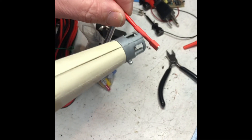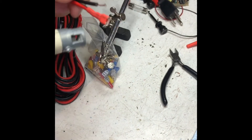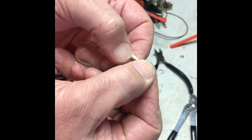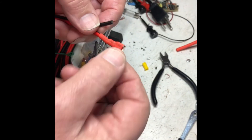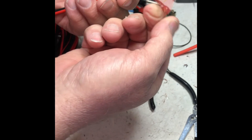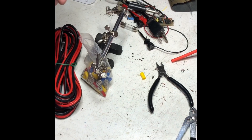I like this better — more water resistant. Plus, you saw how flimsy that piece of metal was — it holds on better. If the original piece had been crimped only, the only strength holding that wire would be these little crimp tabs, and when you go to solder those get gummy and when you pull it off the other side it could pull right off. But this is soldered on, and the heat shrink tubing goes all the way down so you don't have that weak spot at the joint. If you go to bend this it spreads that bend out over an inch of wire, so vibration and things are going to do okay.